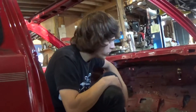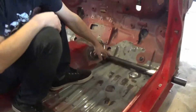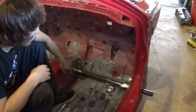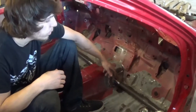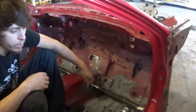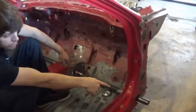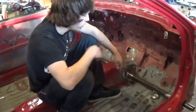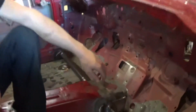The main thing I'm starting with on the cage are these tubes — you might think that's a little odd, and I've never seen that before, but these have several purposes. The first and most useful is what we call a pin stand. You jack the car up and instead of using regular jack stands, you have a special made stand that slides in through the side skirt, so you don't have to take the side skirts off to get the jack under the car. It's going to make it a lot easier and more useful to work on.